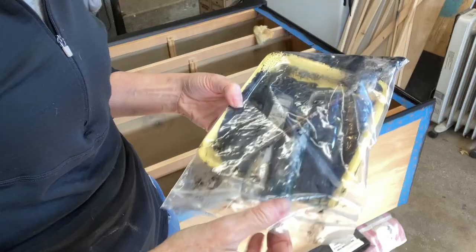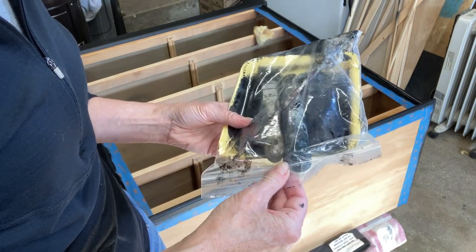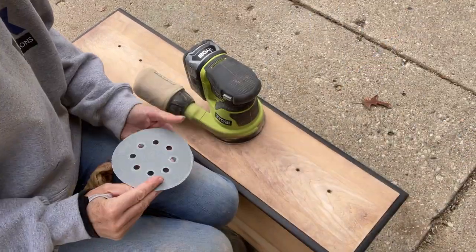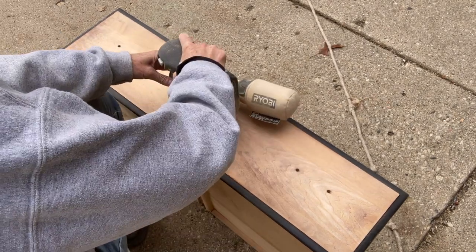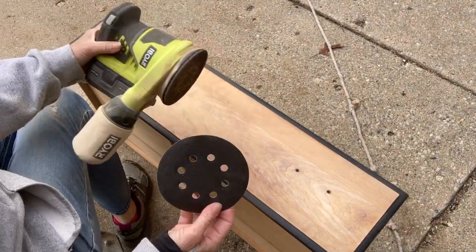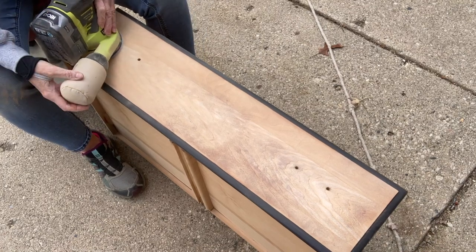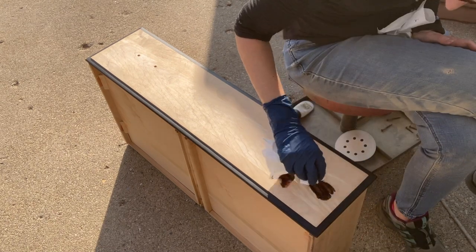You need your paint brushes and rollers over and over again, but not all at once, so you need to find a way to keep them wet. I put them in a Ziploc bag — if you order a lot of hardware from Amazon, you'll find you have plenty of those bags to reuse. The stain I was trying to get off this time was stubborn, so I briefly put on an 80 grit, and that was a bad idea on soft wood. I ended up doing more damage and then had to repair all of the little swirlies before I could go on.